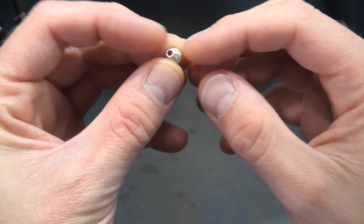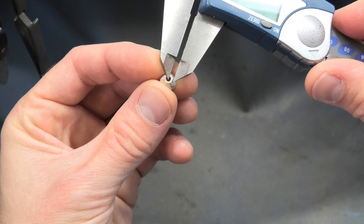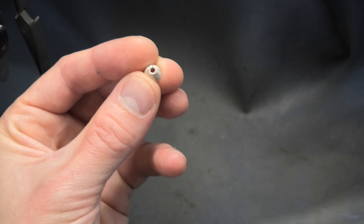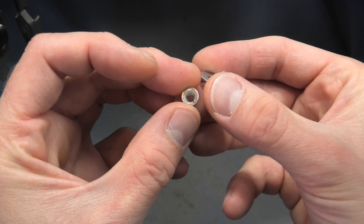I imagine you're thinking of cutting a little circle and just hammering it out, but I don't think that's going to work - it's going to be too severe an amount of stretching on the metal. The way I'm thinking of trying it is using something like this washer - a flat disc with a smaller hole. So basically a small hole with that much distance away from it, making a disc not too dissimilar from the washer but with a smaller hole, and then forcing that down into a cone shape. It might be a handy thing to know if you really need one with no solder join.